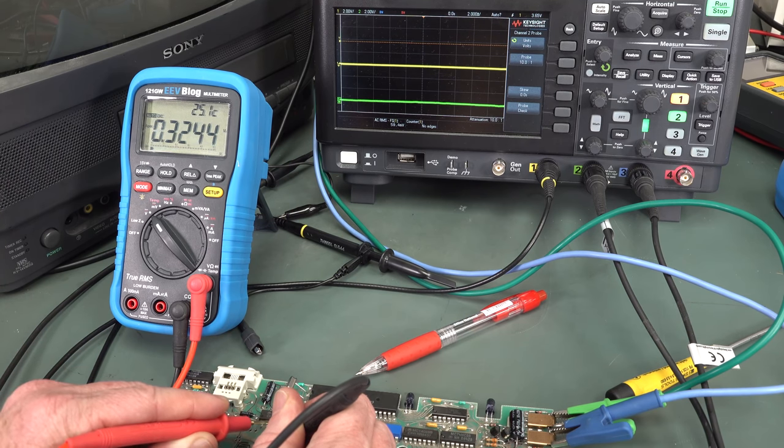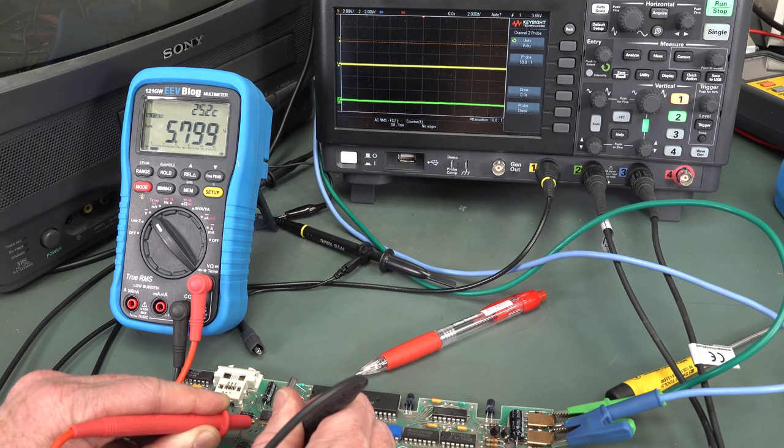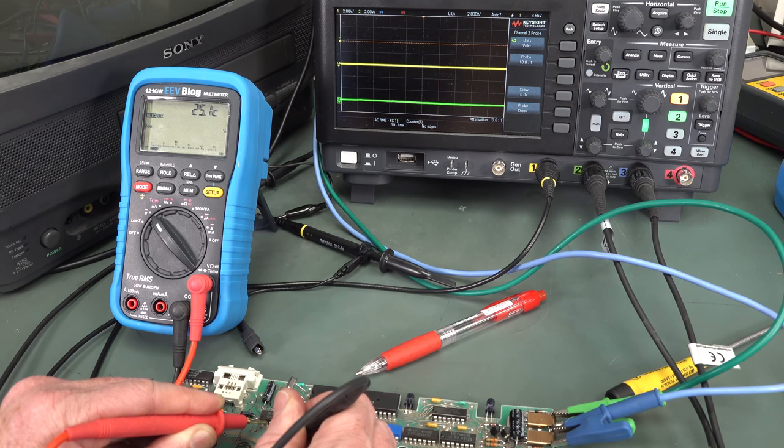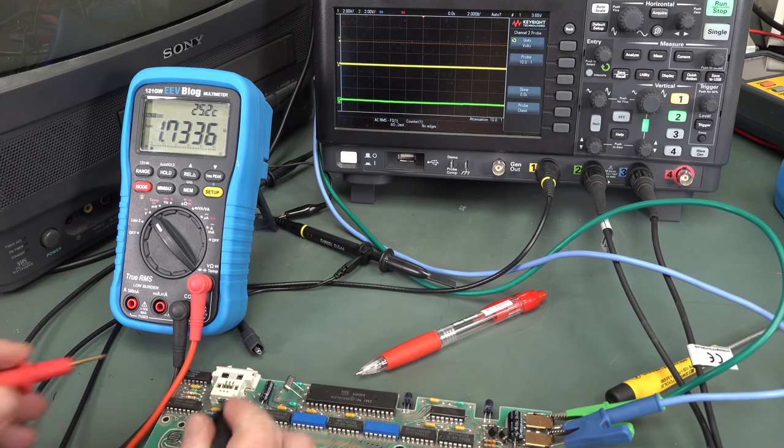Watch this — this is the connector pin there. We're getting 5 volts. If I get in there and disconnect it, like I'm plugging in the connector — boom, it goes to zero, then back to 5. It's got a little lever switch in there that detects plug-in. That seems to be working actually. But something's going on — measuring the voltage on pin 1: 2.2 volts. That's smack in the undefined region of the CMOS gate.